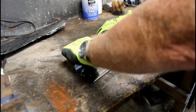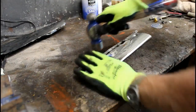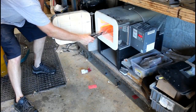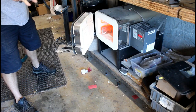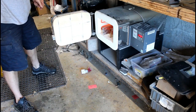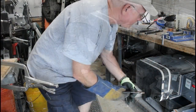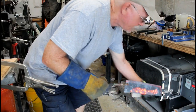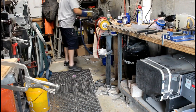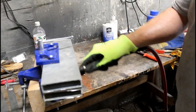This is AEBL stainless steel, and because it's stainless it's going to get heat treated in a heat treating oven wrapped in stainless steel tool wrap. You make as airtight an envelope as possible — double fold every seam and really crease those seams with a hammer. I do batches of four to six knives at a time. They go up to 1960°F for at least a 15 minute hold time. After that, I take them out — you can see the outline of the knife right through the tool wrap — and then it goes into two plates rigged on a vise for plate quenching, which keeps the knives nice and straight and prevents warping. I blow compressed air through the gap to cool it down as quickly as possible.